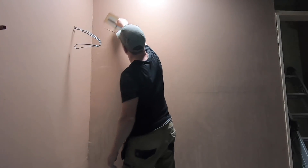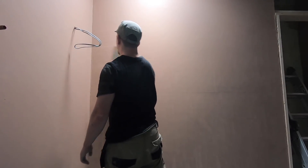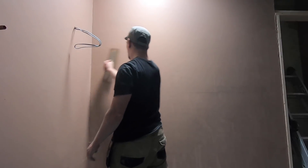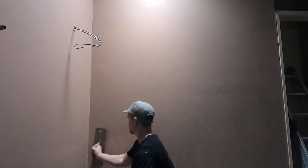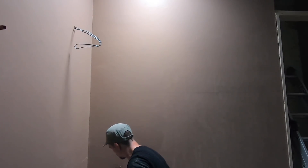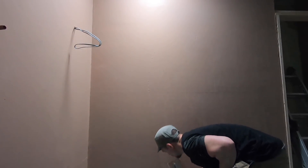The problem now is I've only applied one coat of plaster. Usually the second coat is where you fill any holes and get any hollows out — you really sculpt the wall. But we haven't got that chance here. So what I'm doing is flattening the wall whilst filling any holes, getting the excess plaster — the fat — and filling those holes. You don't want any big gaps because you're not going to get another chance if you're doing one coat plastering. Make sure the area is flat, smooth and filled.